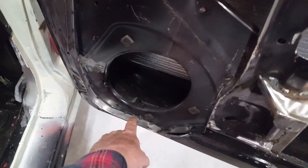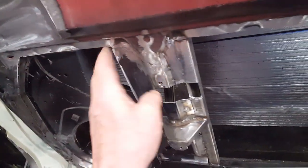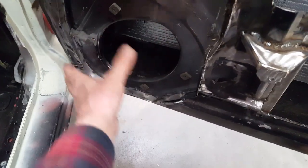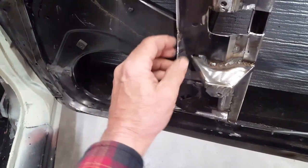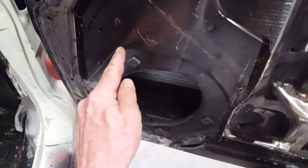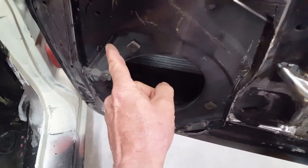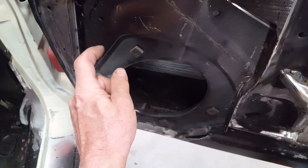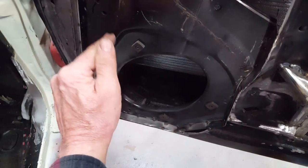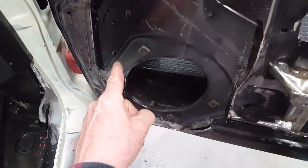What you see here, though, is I've gone ahead and recessed it about 3/4 of an inch, and the reason is everything is up against everything here. When the speaker was mounted flush on the outside of the old Charger door, when I was mocking it up, this top edge over here, which you can't trim because that's obviously the face of the speaker, was very close to the bottom of the dashboard. Well, I have to make a door panel that comes over and covers all of this stuff, so there was no room for any error there.